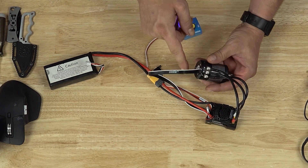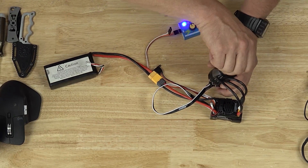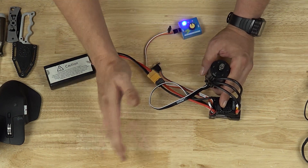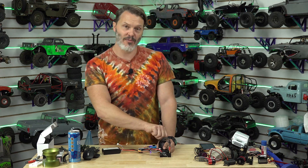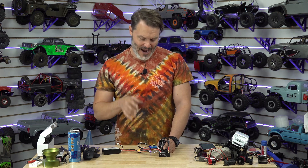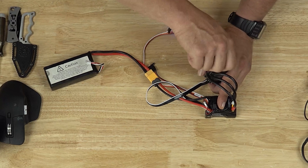When you're using a sensored motor with an RTD temperature sensor, it will actually roll back the hill hold if the motor is too hot — they really thought of everything. Although I'd like to see, at least with sensored motors, something a little smarter that would know the motor's exact position and use that to hold without burning the hold brake. What they've done is what pretty much every manufacturer does: a 'dumb' hill hold that gets no feedback from where the motor actually is. So it's blind — it will always inject heat and your motor will always run hotter when hill hold is active.